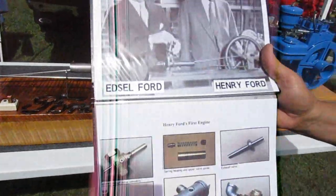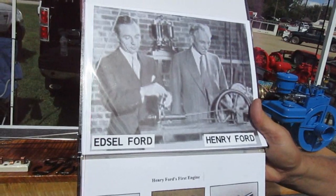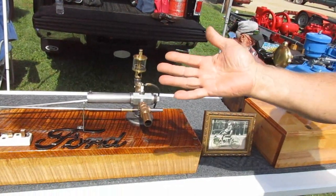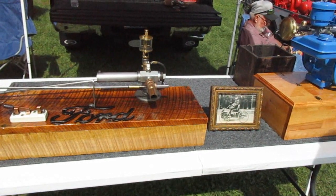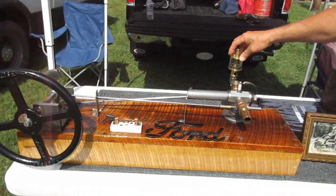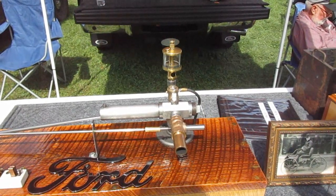This picture — Edsel and Henry actually doing some experiments with the engine while it was up at the museum. They're very critical to get to run properly. There are a lot of adjustments and things that have to be done — you have to consider they're made out of a bunch of plumbing parts, so it's not very precise. The oiler is one critical part. This has to have the glass taken out for your air intake. The original hole has to be soldered shut, and I used a 20-thousandths drill to get the drip for gasoline instead of oil.